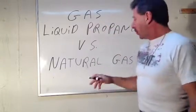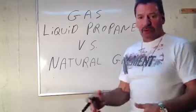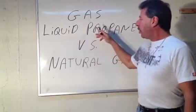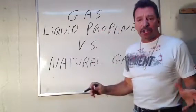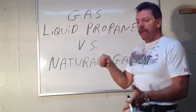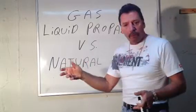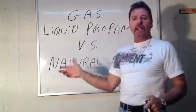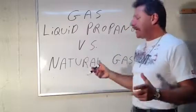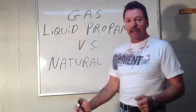Just because we went over a ton of natural gas with the pipe size and BTUs, same thing with liquid propane — it's a little higher pressure. But if you were to take a bottle of propane that you use for your barbecue grill and try to hook it up to a pool heater to heat a pool, that would never happen. That gas would have to come out of that tank so fast it would freeze the pipe — you would never get any gas out of it.